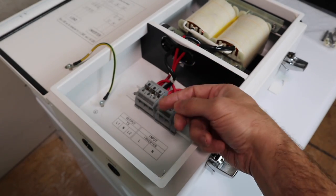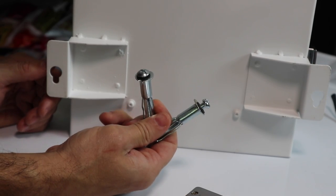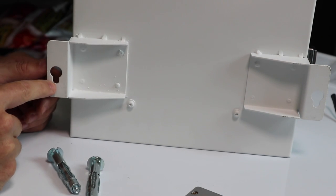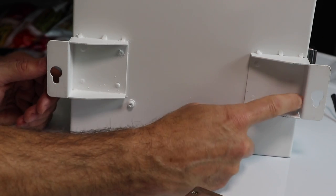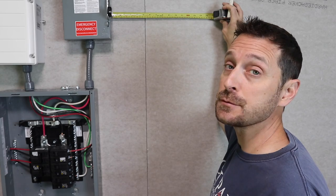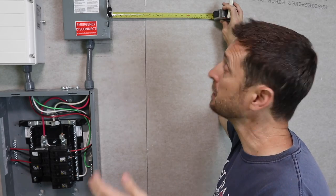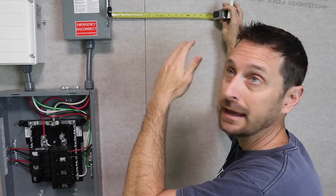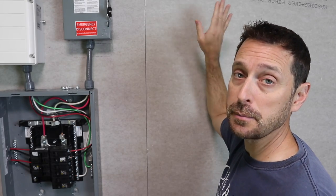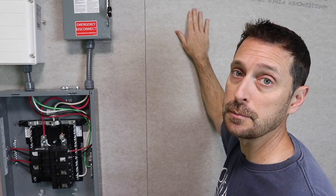Let's get this thing up and connected. We'll mount it on the wall with these anchors — this weighs about 35 pounds, so get something appropriate. We have 10 and 13/16 inches between each one of the mounting holes. It's recommended that you leave 30 centimeters or about 12 inches between the auto transformer and anything else on your wall. We're also going to be mounting it the same as everything else on some concrete backer board.